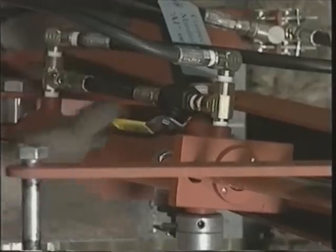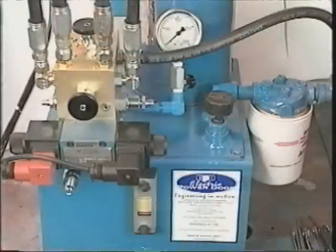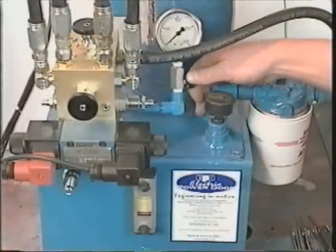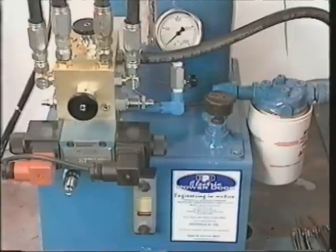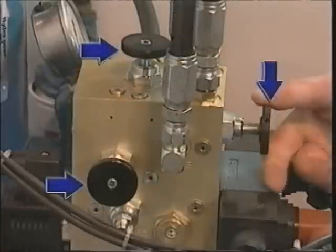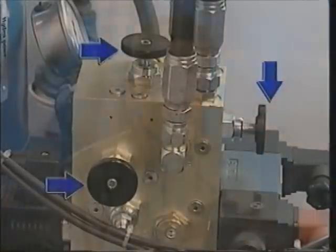Begin removing air in the hydraulic system by opening the bleeding valve located on the hydraulic operators. Also, open the small shutoff valve located at the base of the pressure gauge so the hydraulic oil pressure can be monitored on the gauge when the pump is operated. Verify that the three black manual operation knobs are fully closed. The hydraulic system can be semi-automatically bled even if the electrical wiring is incomplete, as long as there is electrical power to run the motor.